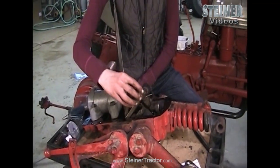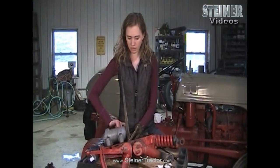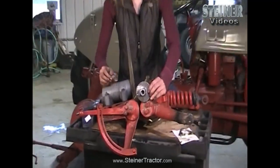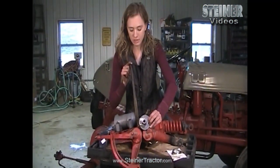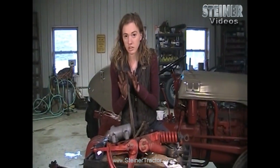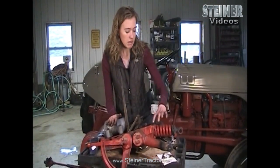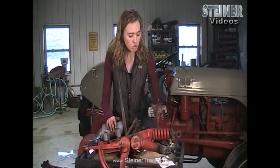I'm finishing the sealer all around the top portion where the gasket is going to go, and we'll also put some sealer on the transmission so there's sealer on both sides of the gasket for a really good seal. If your hydraulics do not work at all under a load and just won't respond, one reason might be within this lever. You can replace this plate — when I move this handle, this rod should respond. If yours doesn't, replace this part. This rod should be straight; it may be bent if your pin was broken, compensating for that. When you drop this into the tractor, make sure the rod falls in the proper place in the valve. Another reason hydraulics might not work is that plate we talked about — you'd remove that nut and replace that support.